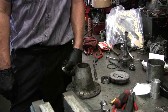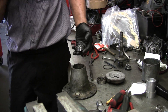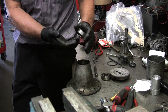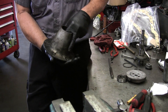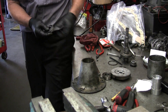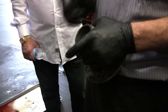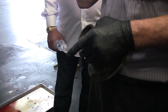This pump is missing some spacers, and this kind of disturbs me, because there is normally a spacer washer underneath this bearing to hold it in a locked place. Somebody has taken this apart and not put it all back together. If you look in here, there's a certain depth that goes to where there's a shoulder, and then there's a snap ring. I can look at it right there and tell that that depth is more than the width of this bearing.